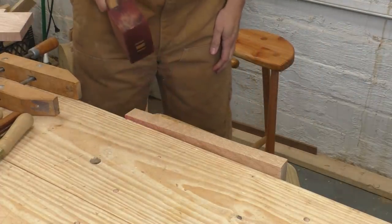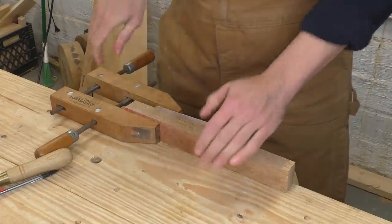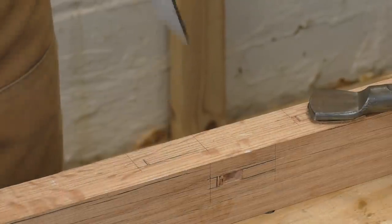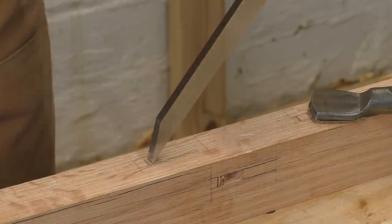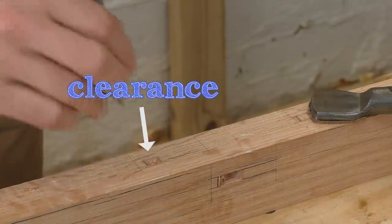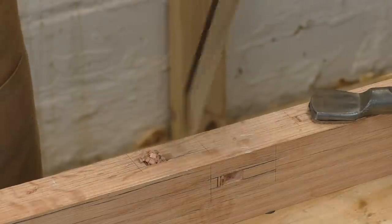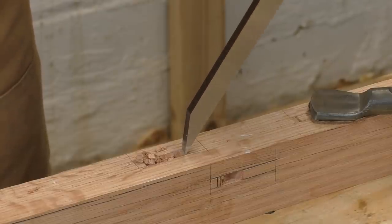To make this big chisel work, we're going to need a complete technique. First, you might not want to chop in your vise — even a good one might let the work slip under forceful mallet hits. A good low-tech alternative is to clamp a board in your vise and then clamp your work to the board. If you keep your work flat on your bench top, it can't go anywhere when you hit it. Start your chisel a good half inch away from your knife line, with the bevel facing toward you and angled so the bevel is plumb. Give it a tap, then walk it back an eighth of an inch and hit it again. And again. Flip your chisel, bring it back to the beginning, and give it a good smack. Now lever out your waste — you've just created an open space. We call that clearance, and it gives the chisel some place to go when you hit it. With clearance in my mortise, I can move confidently along the joint, taking big bites and hitting the chisel pretty hard. I've got nothing but waste behind my chisel, so I can lever back to clear out the chips. I'm far away from my knife lines and I can't hurt anything.